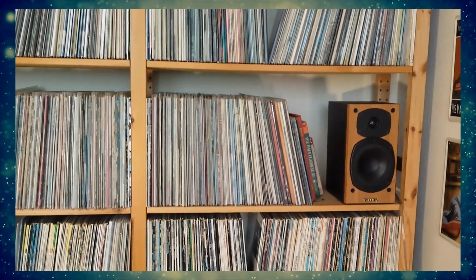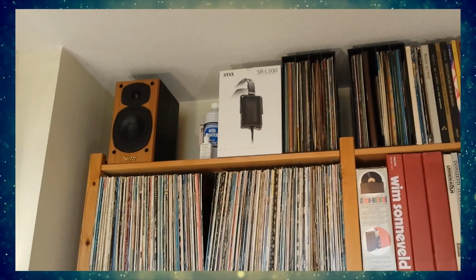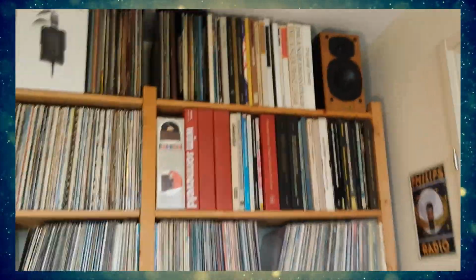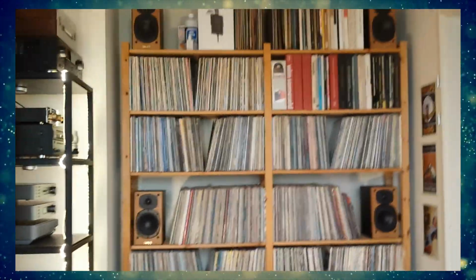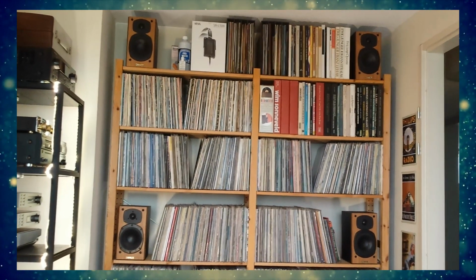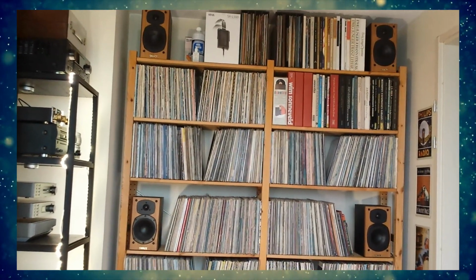What you do is you take a loudspeaker and you place it close to the wall. Then you use a second pair of the same kind of loudspeakers and place it right above the first one. You place one set at ear level and another much higher. And just like when you connect one set of loudspeakers, the ones on the left are connected to the left channel and the ones on the right are connected to the right channel of your amplifier. And all you need is a stereo amp for just one set of loudspeakers.